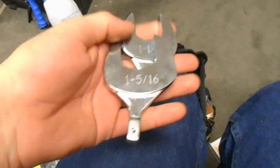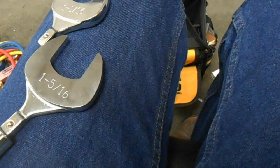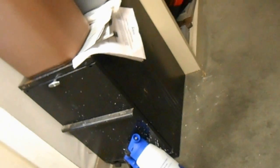Oh, and a super special little torque wrench! It comes with little adapter pieces — you put them on there, set your torque to whatever the manufacturer recommends for that split system when you torque the flare fittings down, and you know you've got no worries.